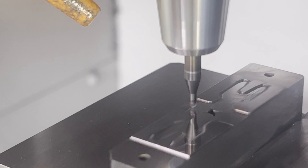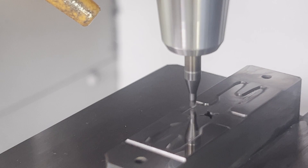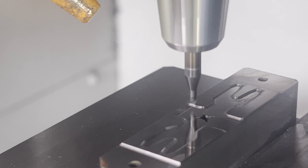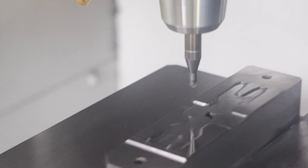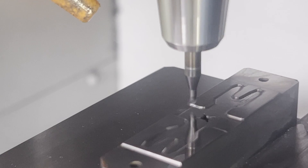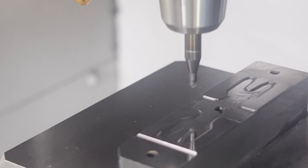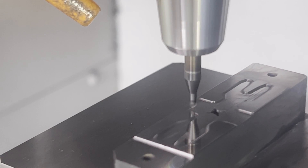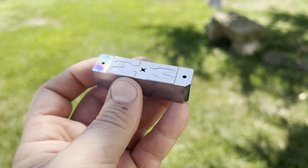Here I am doing my parallel floor finish. After this I'll do a contour cut on the angles and radii. As you can see it's really, really shiny, reflective, and smooth. When you compare that to a finish you get on a RAM EDM and how important those finishes are in certain die applications, you can see why this is a process I really like. Thank you for watching — and check out those rainbows, that's a gorgeous part.